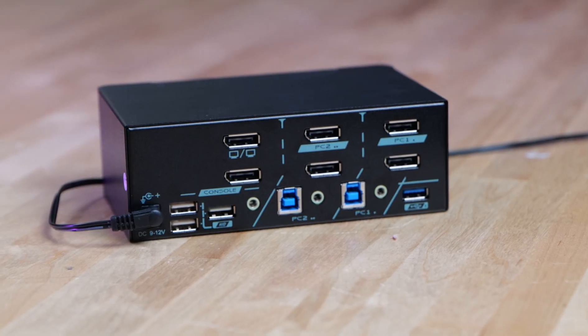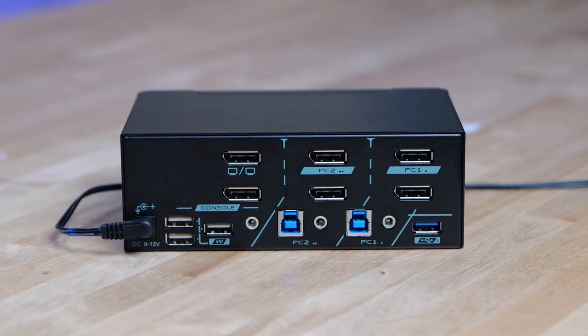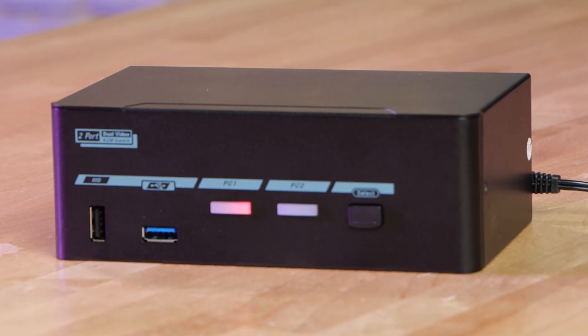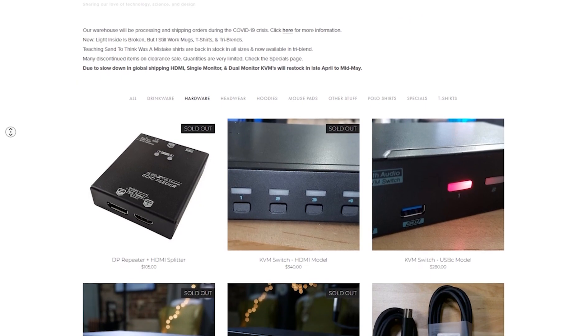The reason for the two-port design is that I couldn't get the signal-to-noise ratio I wanted. There's a lot of bandwidth driving 4K 120Hz even with Display Stream Compression on DisplayPort 1.4, so it's very problematic to have four DisplayPort inputs when you're running at the ragged edge. It's fine with lower-spec devices or if you load your KVM down with repeaters for the phantom monitor setup, but nothing in here introduces any latency because it's just a dumb passive switch. This is available for pre-order on store.level1tech now.